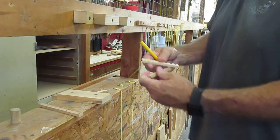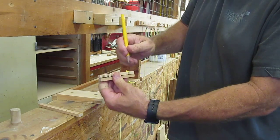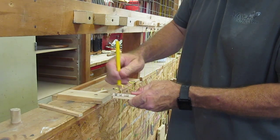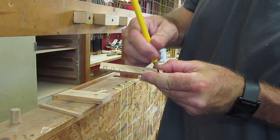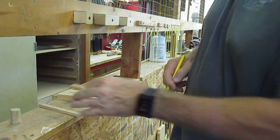Take your medium piece, put it on top like this, trace your holes. On this one you're also going to have to draw the notches, so that when you're done it's going to look something like that — you're going to drill two holes here and you're going to cut these notches out on the scroll saw. That's your medium piece.